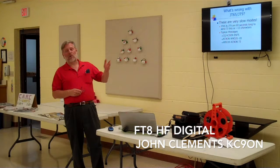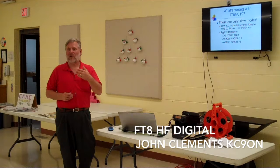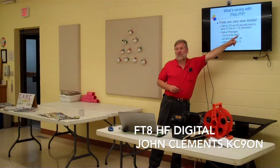Now, what's wrong with JT65 and JT9? Well, they're really slow modes. One transmission cycle is 60 seconds long. It takes 45 seconds to send a whole 13 characters of information. You can't send a whole lot of information.